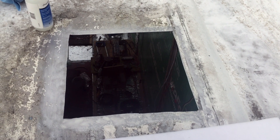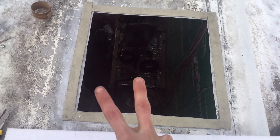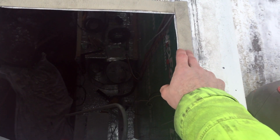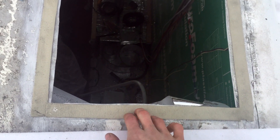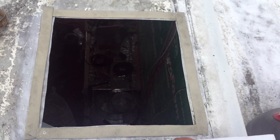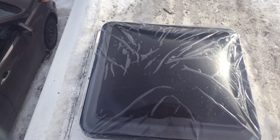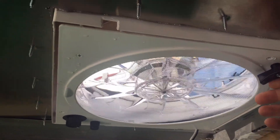Now I can put down some putty tape before putting in the vent itself. It's just one layer of putty tape — I was hoping to do two but there isn't enough left. I'm a little concerned about this bit where there's a rivet underneath that pops up, and also this bit has come slightly unglued, but my roof is flat so hopefully this is enough. I've inserted the vent into the hole right on top of the putty tape and screwed it in place. From the underside all the screws are sticking through, which isn't much of a problem, and this raises and lowers the lid like that.